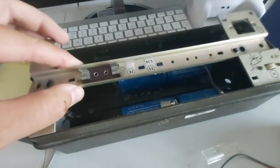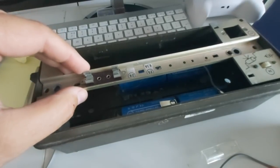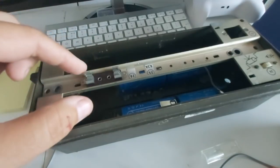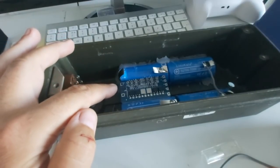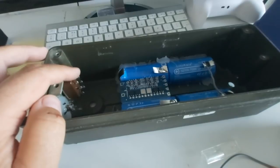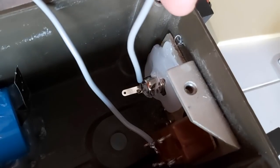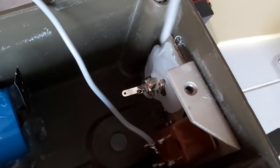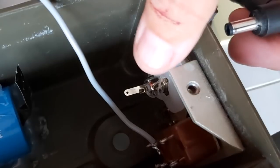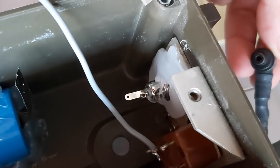There is a bar on top of the case with a fuse holder, so I'm going to use a fuse — always a good precaution. I'll connect that to the BMS on one hand, and on the other hand it goes to the power connector of the radio. I also have to connect the BMS to the charging port. When you solder the center pin of the DC connector, it's a good idea to plug a DC plug into the connector first, because sometimes the plastic softens and the center pin goes off center — so always put a plug in before you solder.